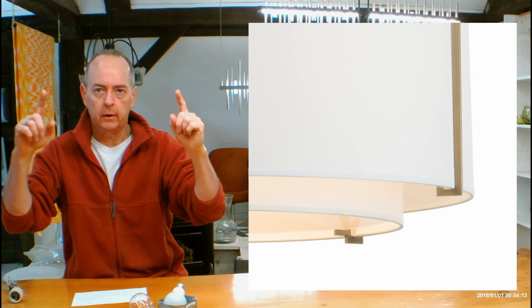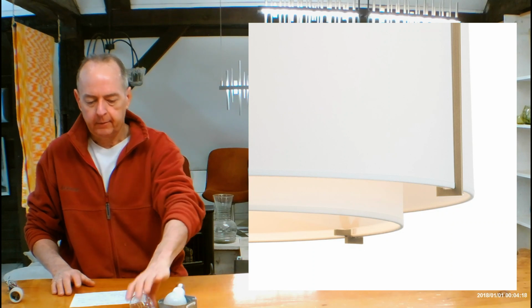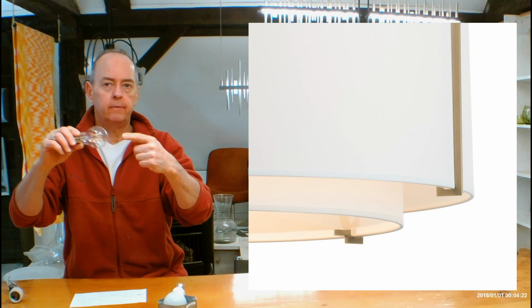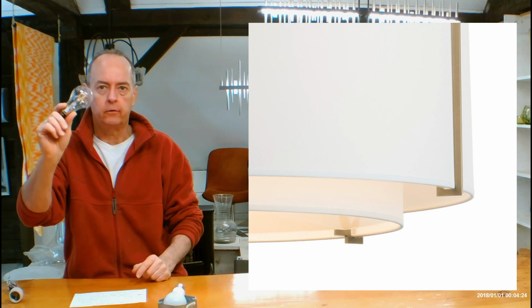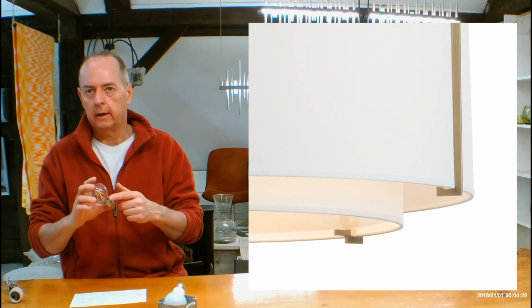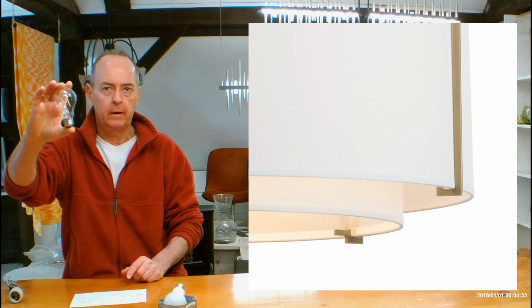That's what's coming down from the bulbs above me. So it's something to think about. Okay, so my take on this would be to probably pick up maybe 3 75 to 100 watt equivalent versions of this someplace out in the world. It's up to you, but I would probably go for the 3000 Kelvin warm white, soft white. Really important, make sure it's dimmable.